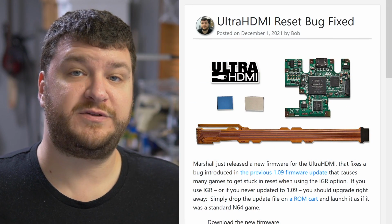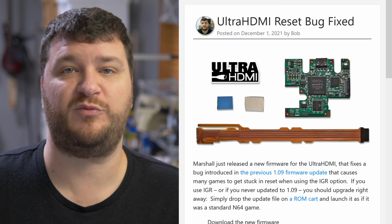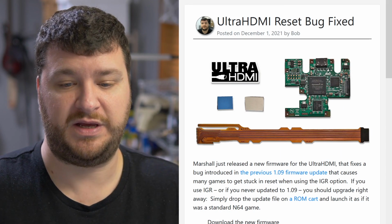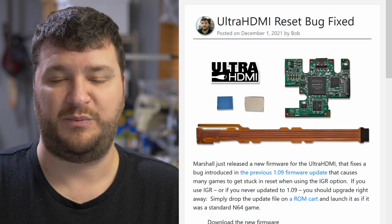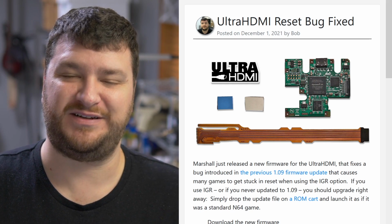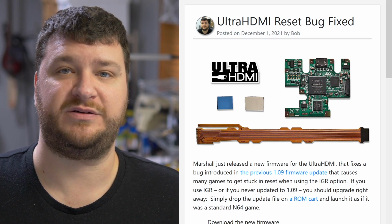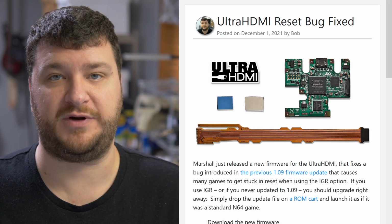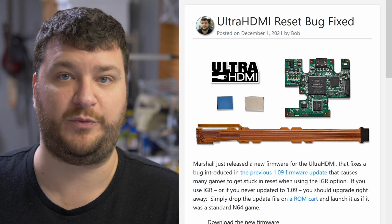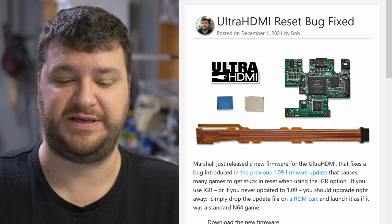But anyway, let's jump in and see what's going on this week. First up, Marshall has just released a new firmware for the UltraHDMI kit that fixes the in-game reset bug that the previous version introduced. So if you don't use in-game reset, this isn't something you would probably have to worry about, but if you're diligent like I am and you like to keep everything on the latest firmware, definitely go and do it. Updating firmware on the UltraHDMI requires a ROM cart, and it's as easy as launching a ROM. The ROM cart thinks it's an N64 game, but you launch into it and it flashes the firmware that way. So if you have a ROM cart, it's super easy. If you don't, that's when things get a little more complicated.